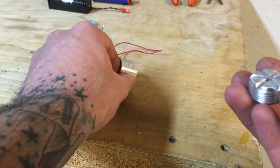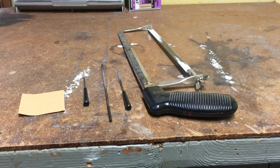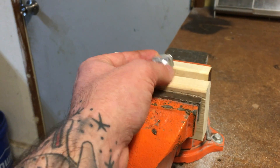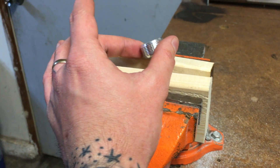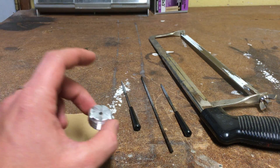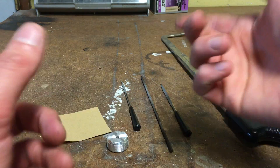I'll show you how I did that. What I do is keep some wood in my vice because it's aluminum so the threads will get damaged really easily. I hold it sideways, use my hacksaw to cut that off, then flip it upside down and grind it flat. Then you set it in that way, and the way I do it now — this is the way to do it 100%.